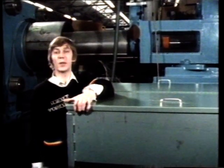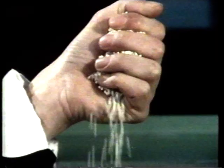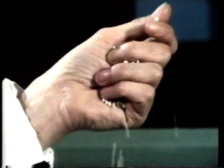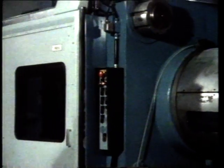Things like the television cabinet are made from polystyrene granules — little pellets. They're fed up through the hose, into the hopper, and down into the machine. The granules are fed into the barrel of the moulding machine. It's very hot, and inside the granules melt down. A screw forces the hot molten mass forward through a small gate, and the plastic is injected into the mould.